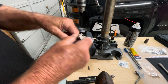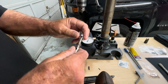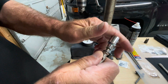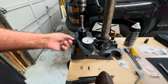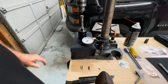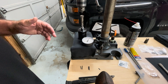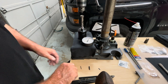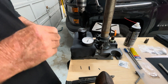I've got a bolt which has a .250 tail that fits perfectly in this quarter-inch socket adapter — you can probably hear it snap in. It sits on the spring tester, which is sitting on a brick on a rag to keep the tester from getting scratched. We're going to test it first with the Colt spring at full 27 coils.